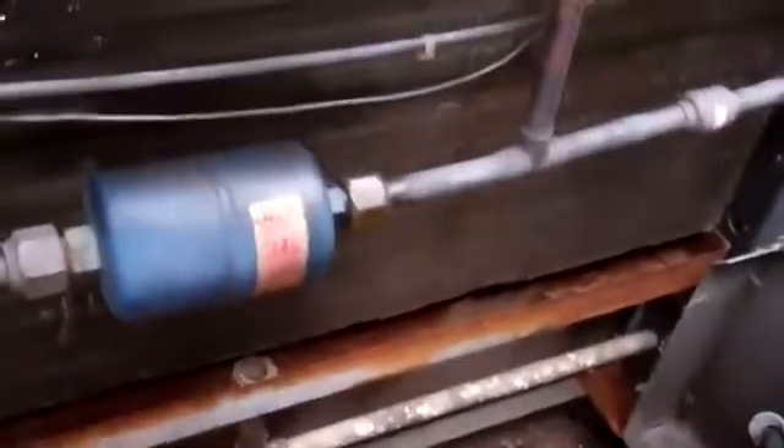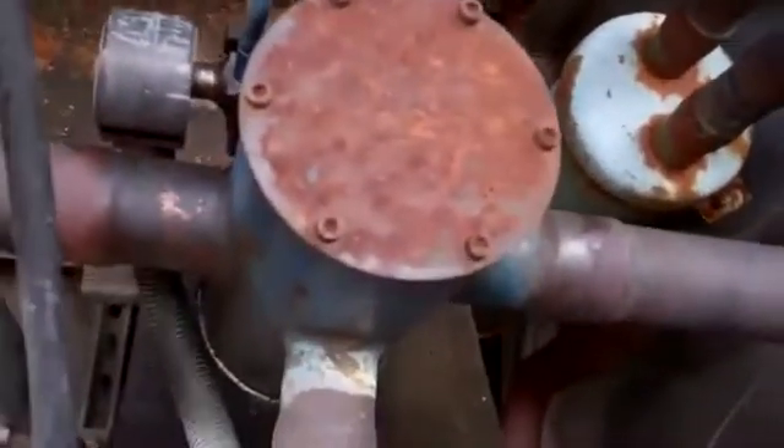This is chiller number 7 that we've looked at today. It's got a really old reversing valve on it which, as you can see, is really oily. It's about to fire up and it's all boiled on the floor there — leak on that, on both those dryers. So that needs a new reversing valve, which is going to be fun because this is a spider-shaped one. And that distributor right down there, you can see it, that looks a bit wet, so we're going to take the end panel off and have a look at that as well.